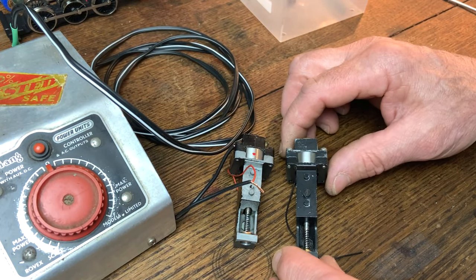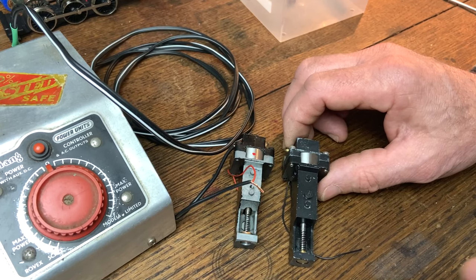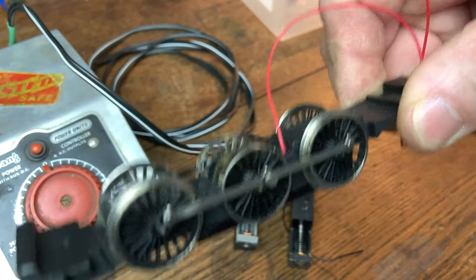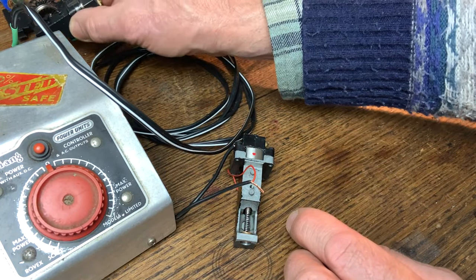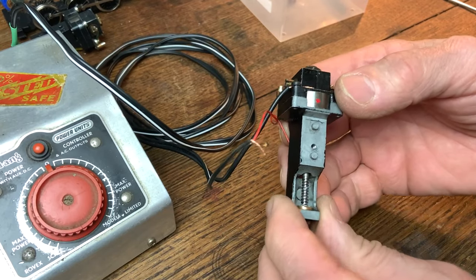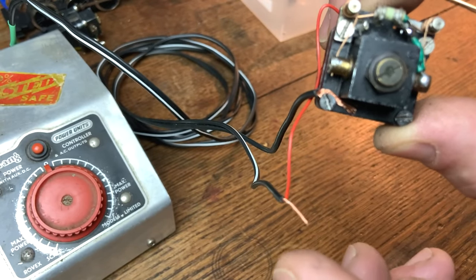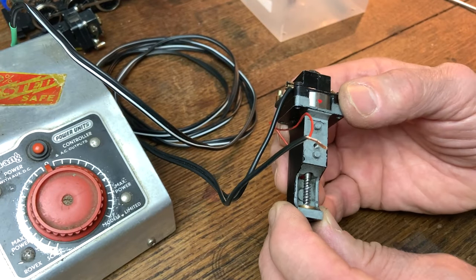This is always the fun bit - connecting things up and trying them. I've made a slight mistake though: I didn't notice when looking at the motors earlier, but we've got two different lengths of ringfields. There are variations, but of course that means the little test chassis I got ready is going to be useless - it's designed for the longer motor and what we have with the subscriber's motor is a shorter one. Never mind - I've connected it up. I've put a little bit of white grease in each of the bearings to hold the balls, and the smallest amount of oil. I've put a wire to the screw and then to the pickup. Brushes are all refaced and everything's back together.